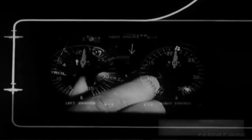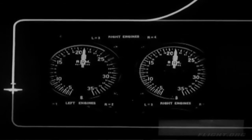The pilot sets the manifold pressure selector to position 8 and adjusts the propellers to 2100 RPM. Just before the final turn, the engineer checks the magnetos and turns the boost pumps on. Around the turn, on the final approach, speed should be at least 140, altitude 800 feet. Also, 6 generators should be on. Finally, the co-pilot lowers the flaps all the way and calls out airspeed and hydraulic pressure as the ship descends to the runway.